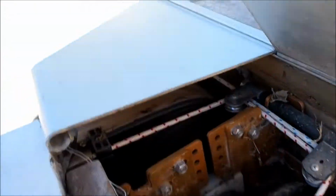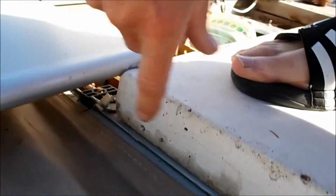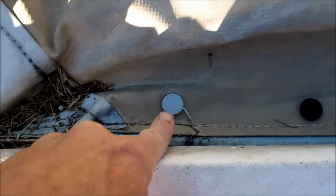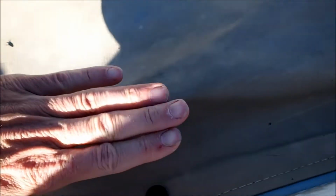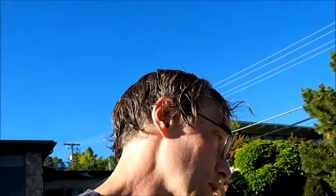Lastly, over here you can see a reed switch, which basically detects a magnet, and coincidentally we have a magnet right here and a backup magnet right there. So when the pool cover goes like here and the reed sensor detects the magnet, the Arduino box will stop the cover. And at the other end of the cover there's another one that we use when the pool cover is closing. So back to the temperature monitoring.